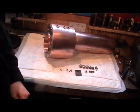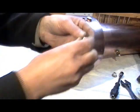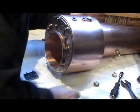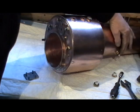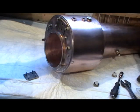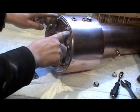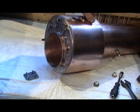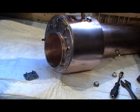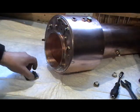I've made a start — I've put a few plugs in already and I'm putting some thread tape round all plugs, just to belt-and-brace them to make sure they seal. I've done the clack valve on this side, put an adapter in the other side to take the water pressure fitting, blanked off the water gauge holes in the boiler — there are four of them — blanked one of the safety valve holes, and I have to leave one open to fill with water and one for the air to escape.